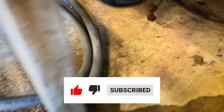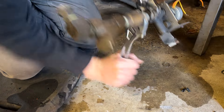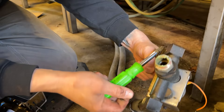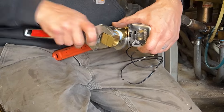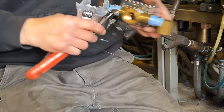I've got a bad Erie three-way valve here. This is how we supply hot or cold water to the pump for a self-serve bay. I'm getting a lot of cavitation in my pump, which is showing me that I am not getting enough water to the pump. The flapper inside the Erie valve is not moving from side to side enough, so it's time to put a new one on.